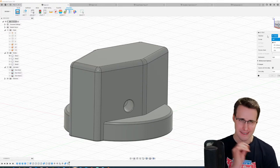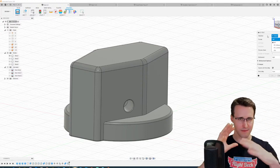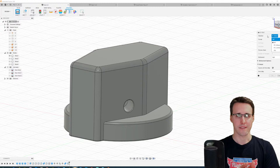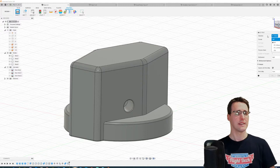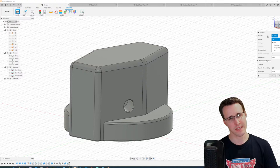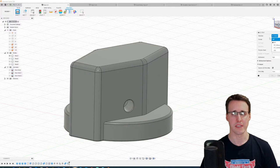I don't know exactly technically why, but I remember that STL files are a set of triangles, many triangles that build the model you have made here, and this can be very much information and unnecessarily big files, and for some 3D printing programs very difficult to get good results from an STL file. In a 3MF file, the way the information about how your model is made is different. Just my amateur knowledge, something like this. So when you export it, use 3MF files.